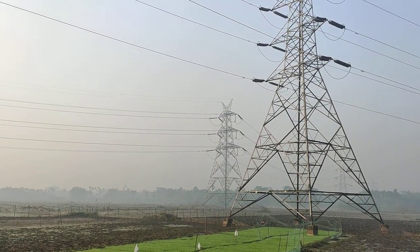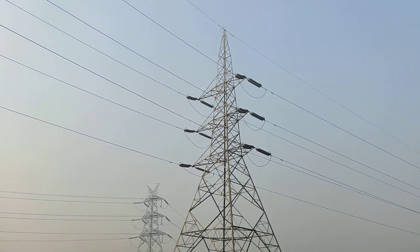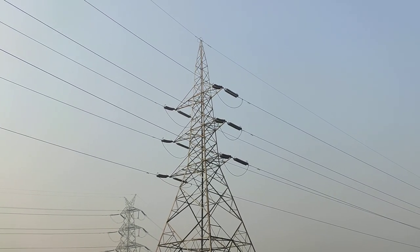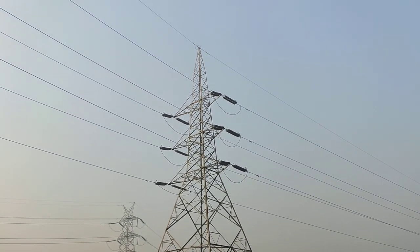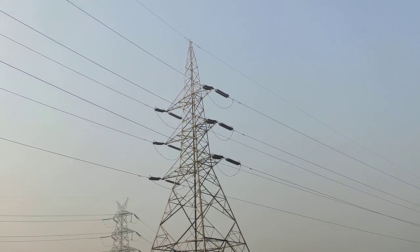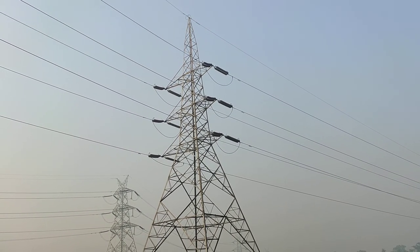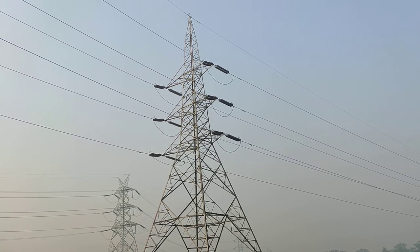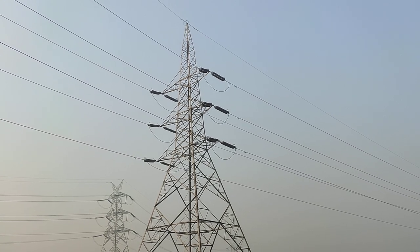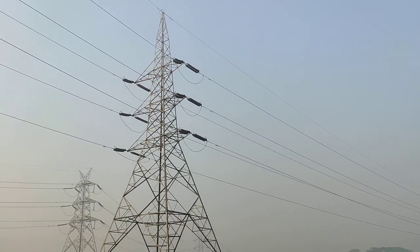This OPGW is very important. First of all, for protection from lightning strokes and from falling of any foreign materials from above — it can divert the falling material if it is sustained to the outside of the conductor or in between the two conductors. It can also catch the conductor and that will be hanging from the OPGW cables.